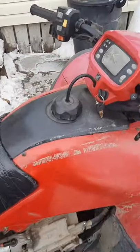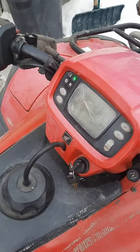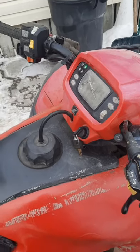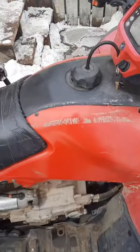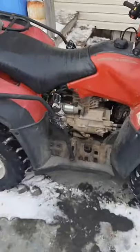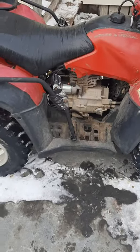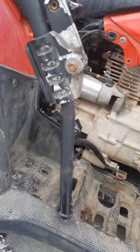She runs pretty darn good — I'll fire it up here for you; it's just been running so it's not a cold start. She's a little ticky; I need to get in there and adjust the push rods at some point, but I've just been using it to push snow and really don't want to take it apart and find out I need more parts until winter's over. My buddy was nice enough to give me the foot stirrups too — those are off a Kawasaki. They were a little big for it, so I just trimmed the ends off, re-welded them back on, and gave them a shot of trim coat. Working pretty good.